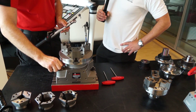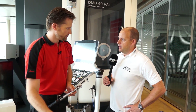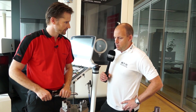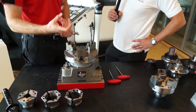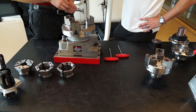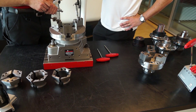It's a matter of seconds really to go from one to another — it depends a little bit on the preparation. So when I have everything prepared, I can do this in two minutes. What about clamping forces? There's a big difference. Normally this chuck with a clamping head has a radial clamping force of 12 to 13 tons — 130 kilonewtons. With a jaw module, I have 60 kilonewtons.